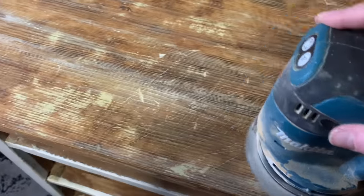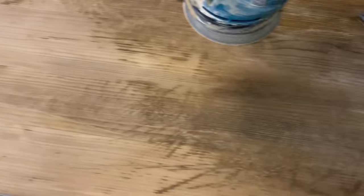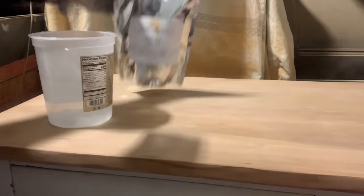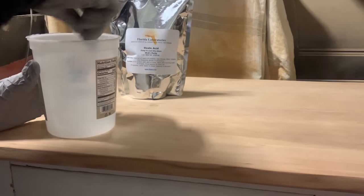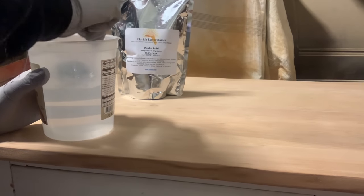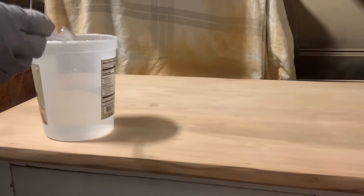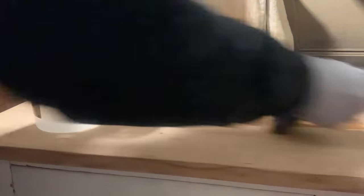This part kind of killed me — my best guess is that it was in a kitchen before it was painted white and they used it as a cutting board, maybe an island of some kind. I almost never go in this heavy with sanding, but I started with an 80 grit and then had to work my way up from there. Even once sanding was finished there was still quite a bit of staining going on, so I used some oxalic acid. I did two rounds of this because it needed it — I'm only going to show one, but you put it on, let it sit overnight, came back the next day, did another coat, let it sit overnight, and then you do a complete wipe back making sure that you get it all off.